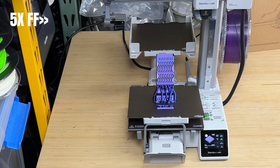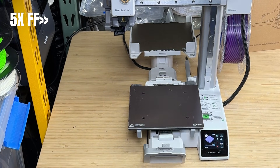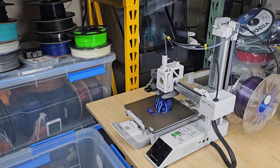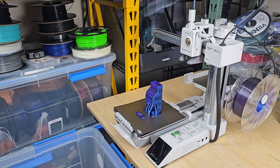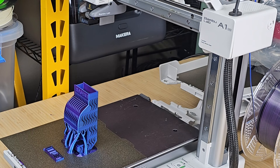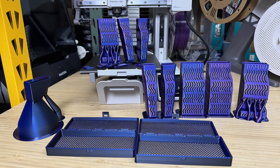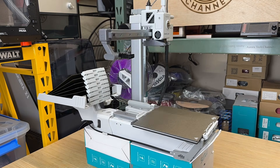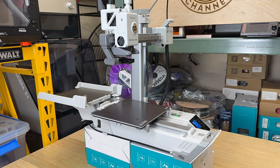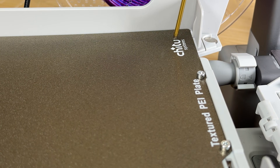The system runs smoothly overall, except for the last plate. It looks like the plate didn't drop low enough for the grabber to catch it. I'll manually load a plate and investigate after this batch finishes. Once the final print completes, it still can't grab the last plate on the tray. Aside from that issue, the rest of the batch looks fine. I rerun the testing G-code to figure out the cause, but the last plate still can't be grabbed. I notice that when dropping the last plate without other plates stacked on top, the small fin on the plate holder prevents it from dropping all the way down.